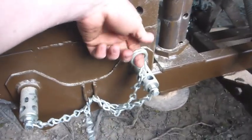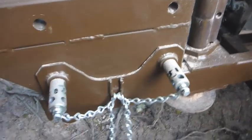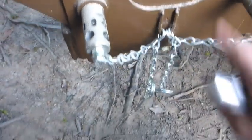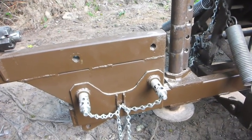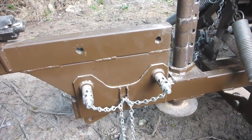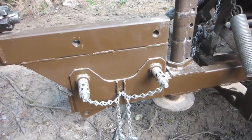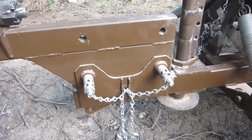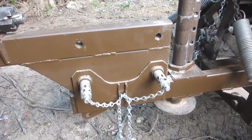Here's my double-height draw hitch — again everything's held in with double coil R clips and operated off this little tommy bar. It's quite simple: undo the two captive nuts and you can flip it over for another ride height. I've got a fixed point on the main drawbar for my safety chain, which is not yet fitted. These machines weigh a shade under three-quarters of a ton, which means they're legal to tow on the public highway in the UK without brakes. Because they're under three-quarters of a ton, providing your towing vehicle is okay with that, you can tow them without brakes. I've towed mine around locally and haven't really gone over 40 miles an hour with it.